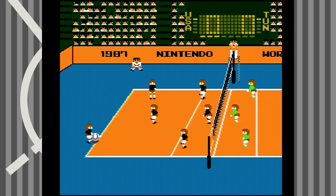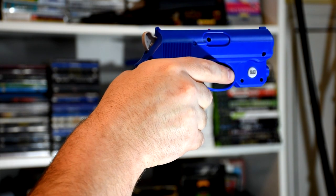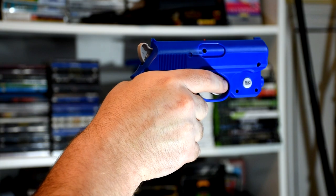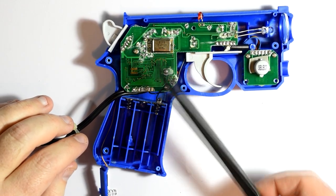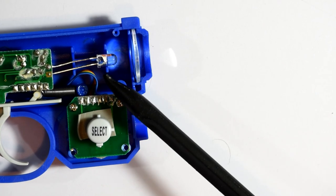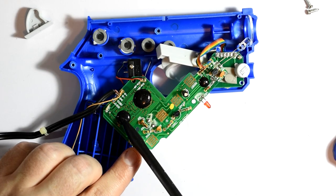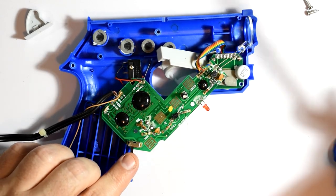The light gun itself isn't actually all that bad — it sits quite nicely in the hand, even if the texture on the handle is a little bit spiky. So it does feel like the hardware was reasonably well designed, and then the software side was just rushed and half-arsed. Let's take a deeper dive into what's in this light gun. This side looks pretty basic — there's just a big clock crystal and a select button visible. We can also see the light detector and this thing is huge. Normally it'd be tiny with a guard around it to block out light so it would only see a small part of the screen, but this one can see pretty much the entirety of it. So it's no wonder I didn't really need to aim, or that second shots didn't always work. On the other side of the board we find more buttons and two globtops — one is likely the Famicom on a chip and the other contains the ROMs.